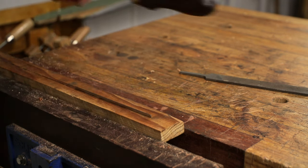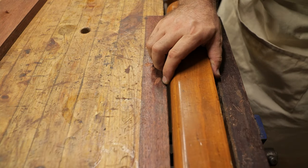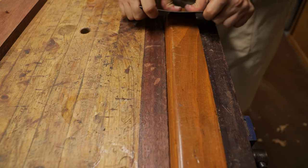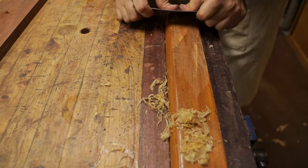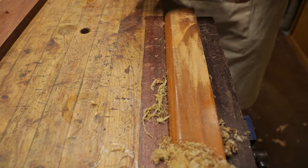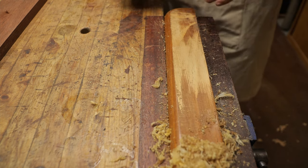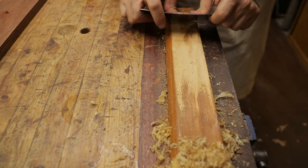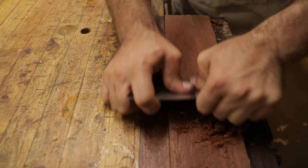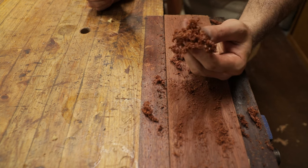Let me get a piece of wood in here and we'll give it a test. What I've got here is a piece of pine that's already got some finish on it — a film finish — and a bit of jarrah. To use a card scraper you just put a little flex in the middle and run it. You can see it's slowly taking that finish off. It's quite a hard finish so the hook gets a little caught up on it, but we can see it's taking very, very fine shavings — not dust, shavings. That's how you know it's sharpened properly. And because we did hooks on both sides you can turn it around and use the other side. On the jarrah, which is a nice hardwood, you can see we're getting very fine shavings as well.